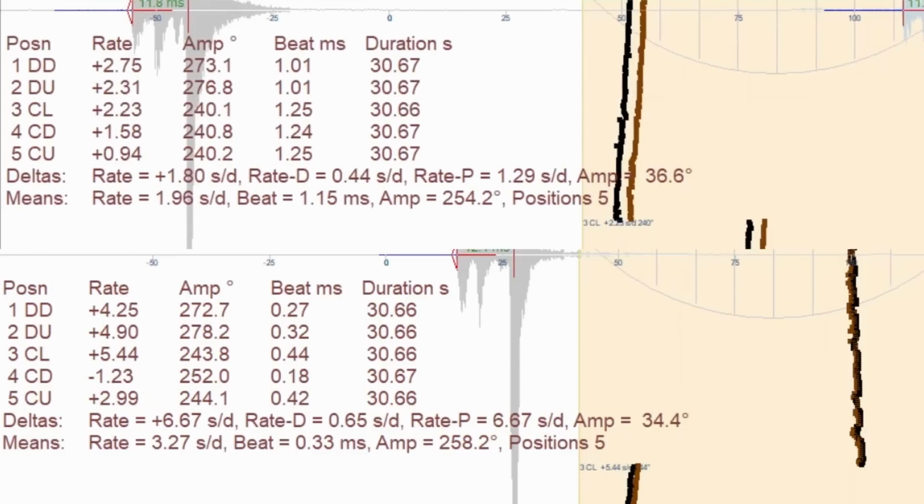regulation. Of course, the whole reason we did this to begin with was because of the high beat rate. I still contend that, on a personal watch, I would have left that because the delta and the average rate were even better than what we have here. But if you were doing this for somebody and you didn't want to have a higher beat rate, this is the adjustment you can do. So that's it for this one.